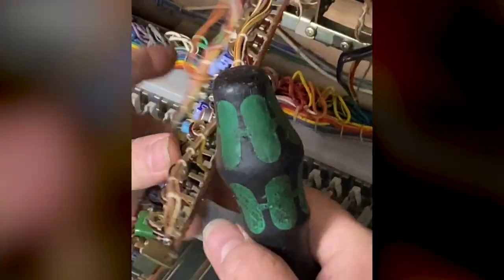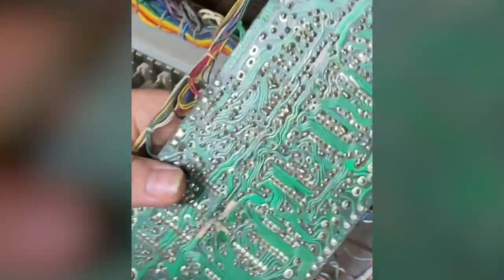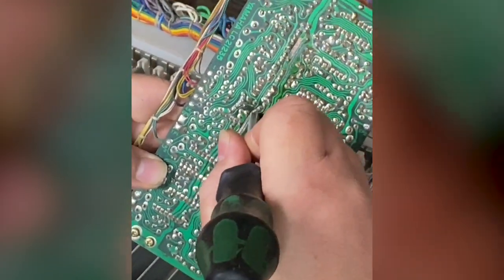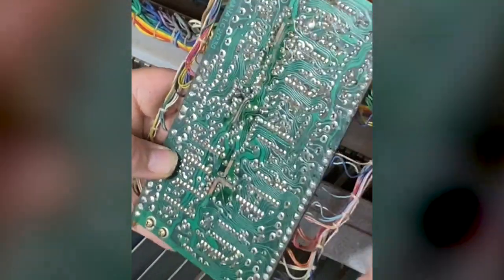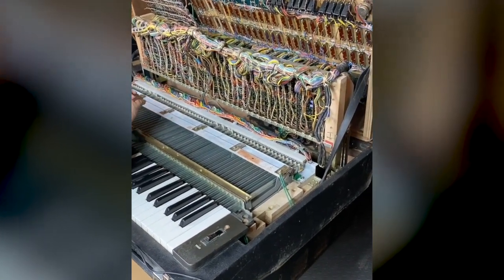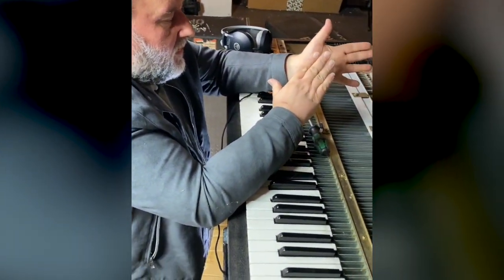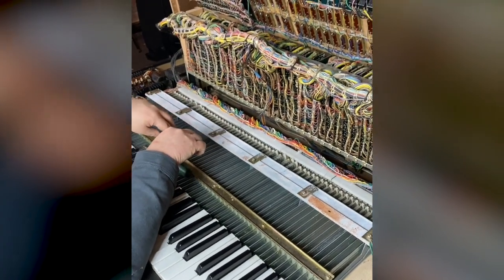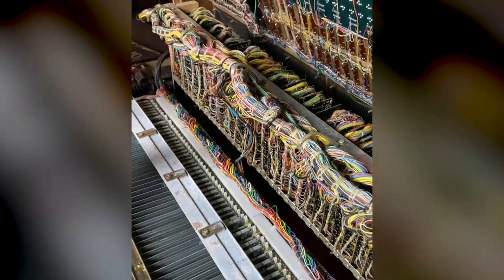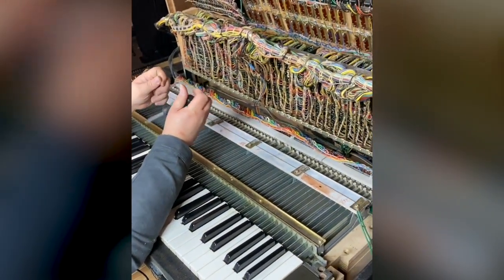There's no damage on the top side — I can't see any corrosion affecting other components, and the IC chips look really good. It's only on the back side where there is the solder resist layer that you can see it's got under that — it should be bright copper, but it's very dull. Only when you remove the components and solder resist will you know how bad the corrosion actually is. There's still potential for voice chip or VCA related faults, as well as broken or corroded tracks. If you're going to buy a CS-80, at some point you will have to change some of the IC chips. As a CS-80 owner buying it in this condition, I would not be surprised for a tech to say it needs a complete refurb and overhaul. I wouldn't purchase this hoping to get away with a recalibration or a quick repair — it deserves better than that, but it does work. I'm really, really surprised.